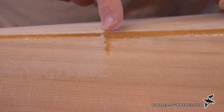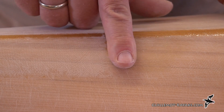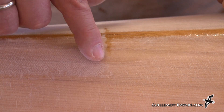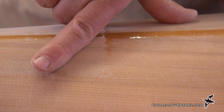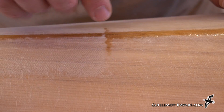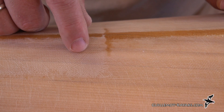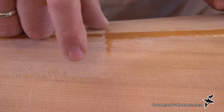Back down here where the end of the tape ends, it's going to be tricky to blend this in. I'm going to have to sand it back farther to get this little step down to disappear completely, and I'll do that with some hand sanding. I could have cut this bias-cut piece at a little bit of a diagonal back here, which would make it a little bit easier to blend in — I just didn't do that this time. This gives you something to look at to see what it looks like when you're sanding into the cloth: here we're just tagging it, here we're sanding deeply into it, here we've sanded almost all the way through.